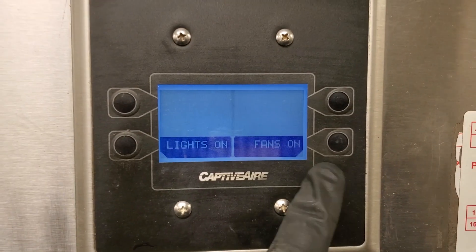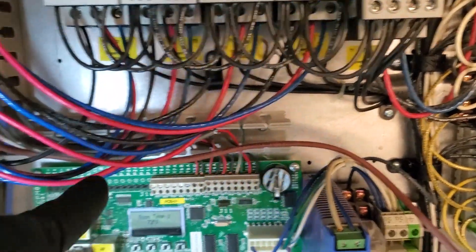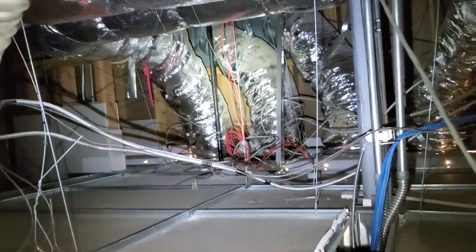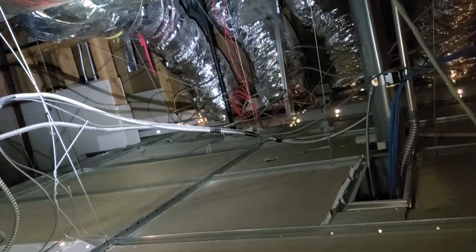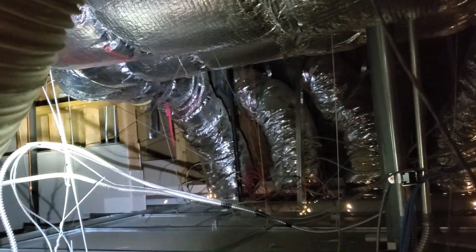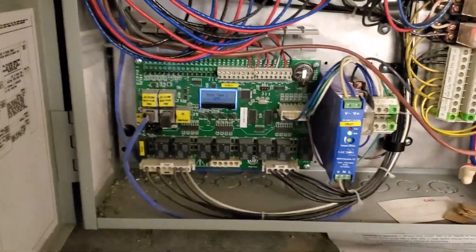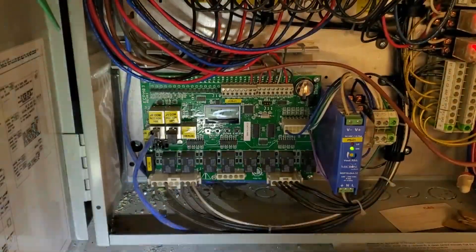I can't do it right now, but for now we just leave them in fans-on mode and we should be good. I was kind of guessing with the zone sensor, so what I did was I found it on the bottom over here — bottom right, these two right here — and I pulled the plastic cover and traced it back. I noticed that this gray jacket is going up, and I followed it up into the attic, sitting right here, and then just kind of looked and watched where it went. I saw it go up on top of there, down over there, and then I noticed it's coming down the duct and going right over to that wall. That's when I walked over to the wall and saw that there was a zone sensor on the wall — so that is my room temperature sensor. Because they have a door open right now, it's dropping in temperature — it says 72 right now. But when they shut that door and the heater vent blows on it, that's going to go back up to 90, 100 degrees, maybe even higher.